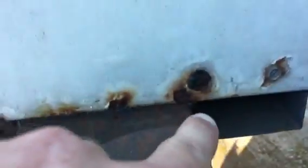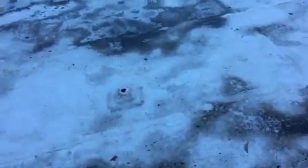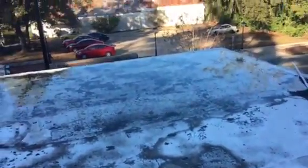That tells me that the whole bottom side of this AC unit has water where it shouldn't. You can even see right there — that's wet. So these AC units definitely need to be serviced, Ms. O. I believe that's going to be your culprit, because everything on the roof looks nice and tight. It's got to be coming out of those ducts on the interior of the building.